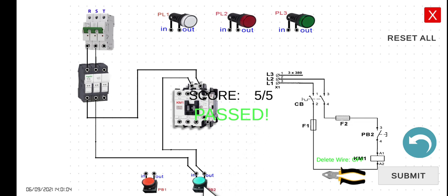If you press PB2 now, as of this moment you will not be able to hear the sound because of the software we're using. However, if you perform this in the physical electrical wiring simulator, you will hear a sound when you click — activating the magnetic contactor. When you press PB2, the magnetic contactor is energized, and when you release, it returns to its de-energized state. In the next lecture, we will be using the normally open and normally closed contacts. See you in the next lecture.